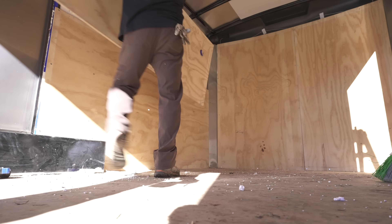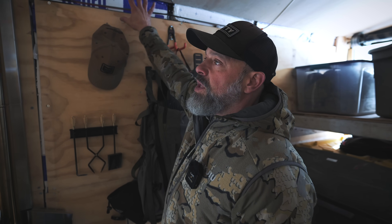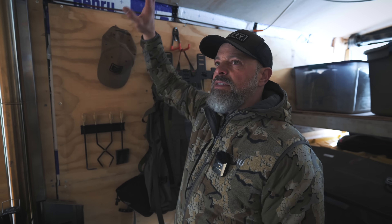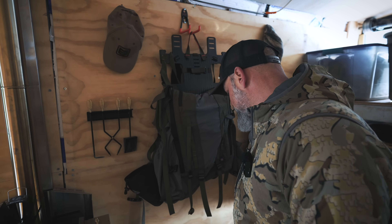What still needs to be done: still need sheathing over the curve, still need to finish screwing down a lot of it — it's half screwed down. And spray foam — I've got spray foam to hit all the little cracks, especially the underbelly of the trailer. There are areas down around the wheel wells right now where I can see daylight coming through. Got to finish that. Then it's just trim work inside and the barnwood finish.